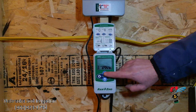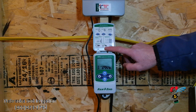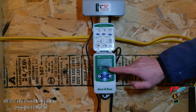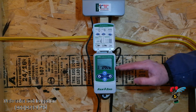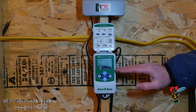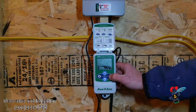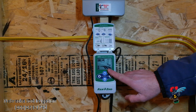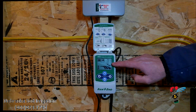If I hit the plus again, it's gone to another function — override the sensor for 72 hours. If I hit the arrow over and left it at this point, I would have overridden the rain sensor for 72 hours, so it doesn't matter how much rain we've got, the sensor will not shut the system down. Currently, I'm going to void those out. Arrowing over, this is telling me — because I have a sprinkler icon down here — that the system is being allowed to water because there is no rain in the rain gauge.